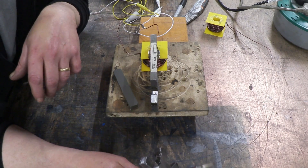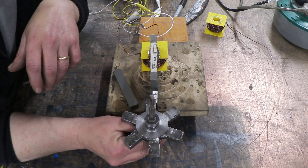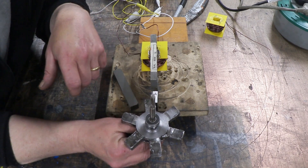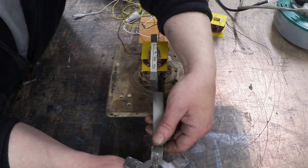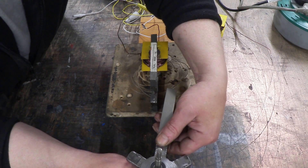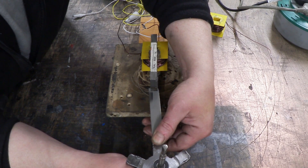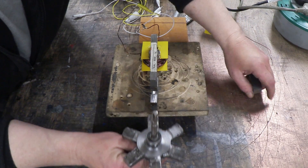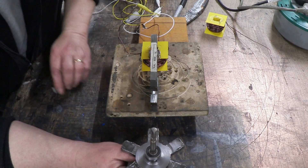There is one other thing to notice as well — torque is force times distance. Now I've put this here because I took it from the generator, but there's absolutely nothing to stop me having a much longer arm. So if we have a few more coils and a longer arm we will clearly get much more torque on the rotor. We could improve torque on this just by increasing the distance of the metal lump from the center of the axis.